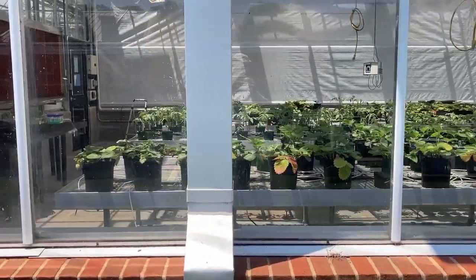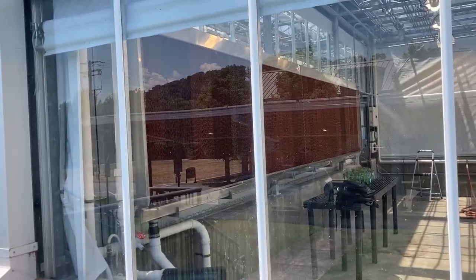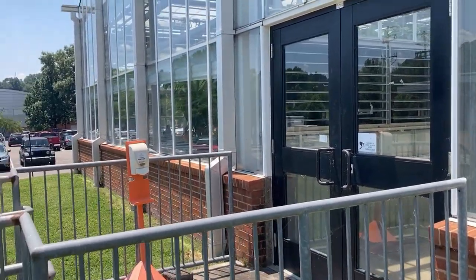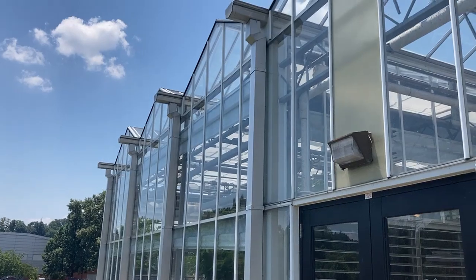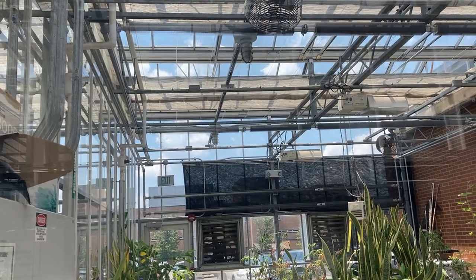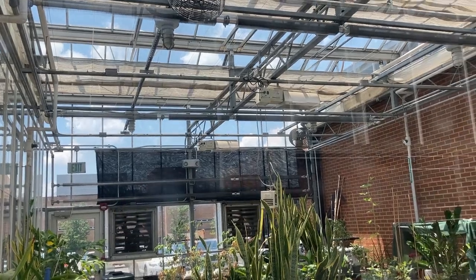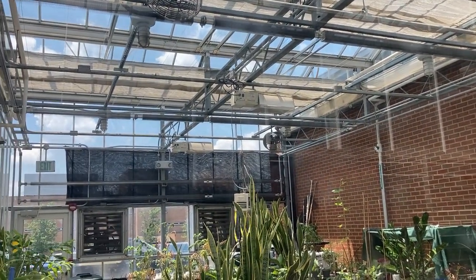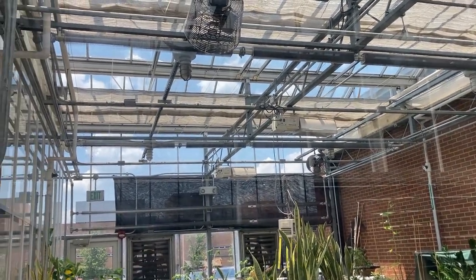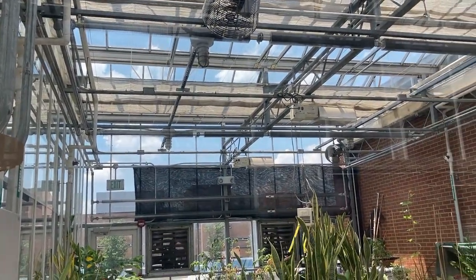So just showing you some of the greenhouses on the interior, what they're doing here. Your water supply here is fed from the central corridor, which I think is kind of an interesting design. In this case, the recommendation was to have the shade cloth on different circuits, so you can control one independent of the others. The other recommendation was to have independence on the lights. Instead of having them all on the same circuit where you have to turn them all on at the same time, have them separately controlled with different switches. That helps you better optimize your greenhouse space in this particular glass facility.